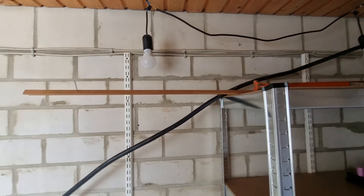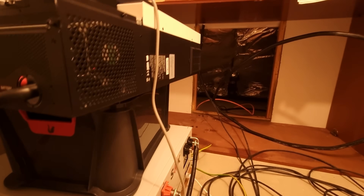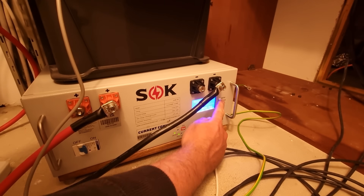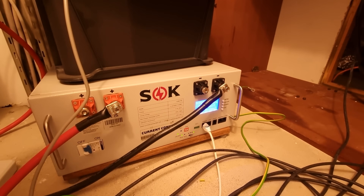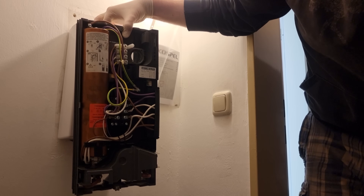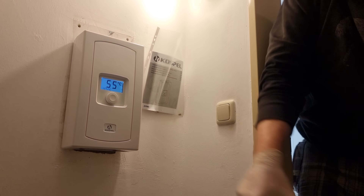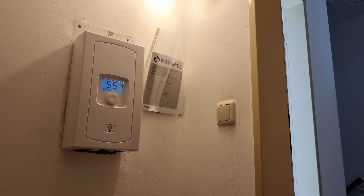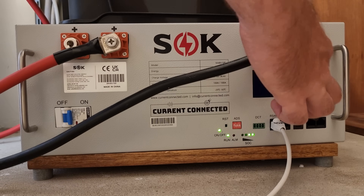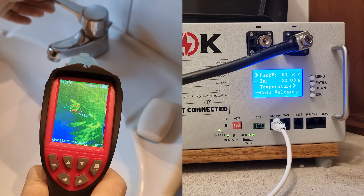The wiring for the real final installation out here is pretty much in place. But before committing to it, I wanted to do a bit more realistic reliability testing. So I've temporarily set up my loud hot air spewing power plant in here. I just spliced it into my electrical sub panel, whose lives were disconnected from the main panel elsewhere. For a full scale balls-to-the-wall load test of the 100 ampere capable 50 volt SOK battery, I'm going to have to draw 5 kilowatt. I've just changed my instant tankless electrical water heater to make that possible — the old one was a 21 kilowatt three phase unit, an absurdly power hungry beast. The new one is only half as powerful, and it can be further throttled to 5 kilowatt with internal dip switches. Warm tap water has never felt that good before — because it's free, I might actually take a shower for once.